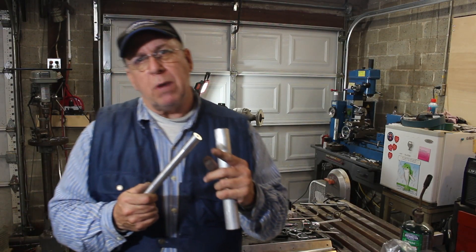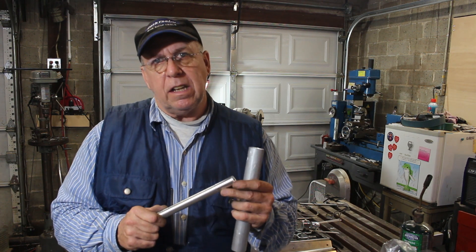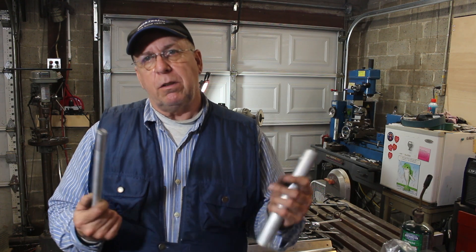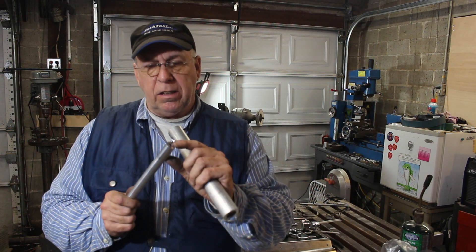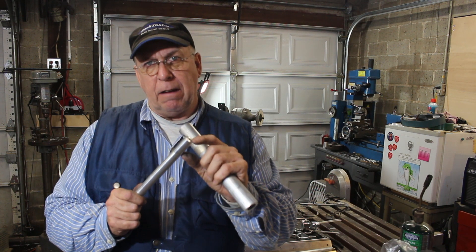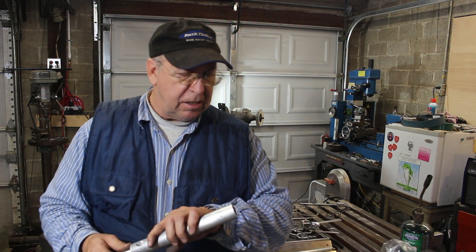I asked my friend Harold over at the Amateur Redneck Workshop if I should put a piston ring in here. He said he cut a piston ring groove for his but it just filled with plastic anyway. So I'm going to rely on the length of the contact area — about an inch and a half — to seal the plastic and keep it from blowing back past the piston.